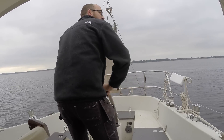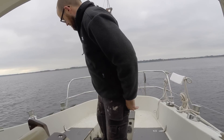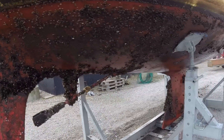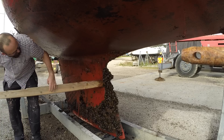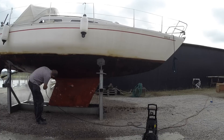I'd misunderstood how to get in through the shallow channel that leads into the yard. Luckily, the bottom is very soft mud, and there was no damage at all, but unfortunately there were a few spectators on shore. As soon as Obelix got up on the hard, I understood why she didn't handle like she used to. Her bottom was infested with enough clams to feed a small village, and also there were a lot of barnacles, so I scraped those off using a long wooden board and gave her a good pressure washing below the water line.